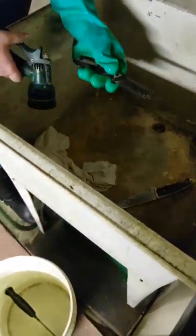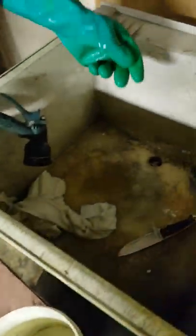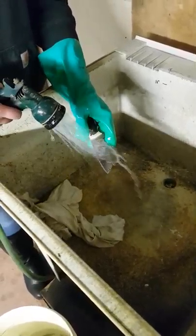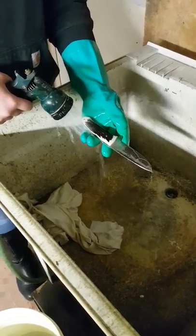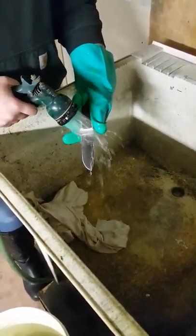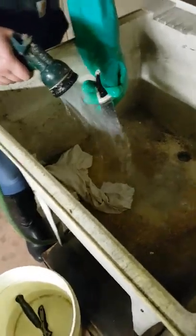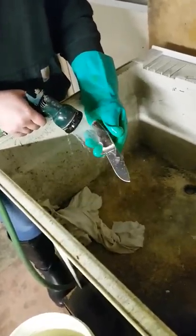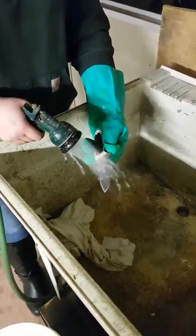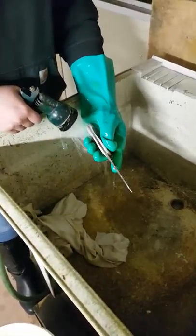Now that all the excess is washed off, doing this test, we also find out if the scales have been put down properly — if there's any gaps under the scales. It shows up when we're doing our dip test. You see the bubbles come up, so that means the penetrant is getting under the scales. We didn't actually show it because it was very little, but we saw a couple of little bubbles coming up. Right now she is doing the Boker, which has been around for a very, very long time.